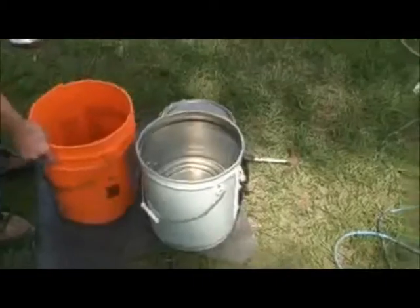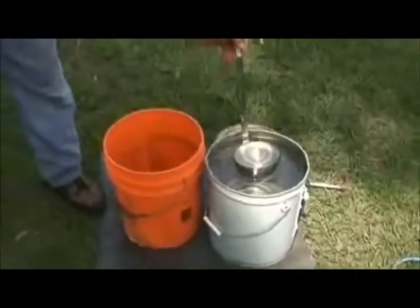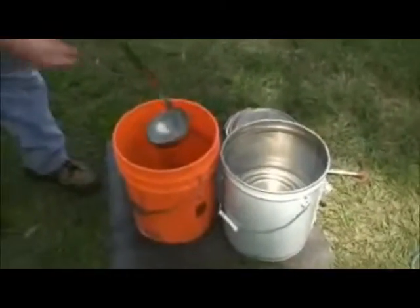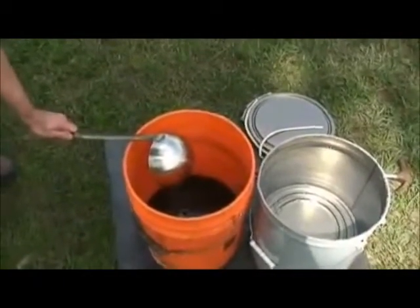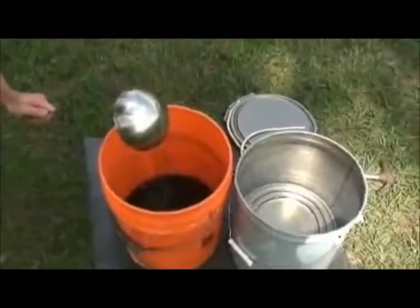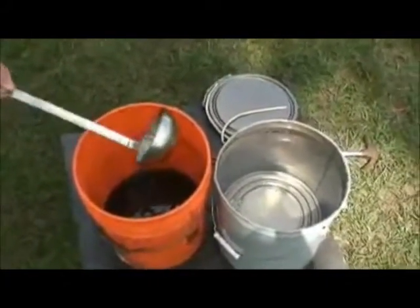Place 4 pounds of patch rubber into the bucket and add 1 scoop of Playground Pavement Binder. Beware of cheaper binders that range from 1/6 to 1/5 the strength of Playground Pavement Binder. If you use a cheaper binder, you can expect to re-repair your work at a later date. Our binder's tensile strength is 6,600 PSI and its elongation is 600%. If a polymer company cannot meet these numbers in writing, don't buy their product.